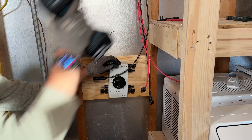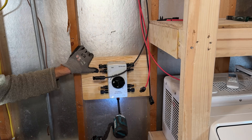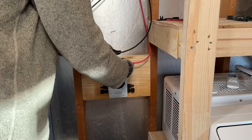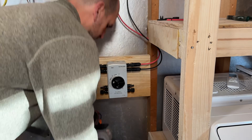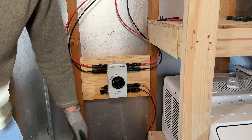The DC isolator is very easy. I have those two sets of MC4 cables coming down with two mounting screws, and then I have my DC isolator mounted. I connect up inputs one and two, and then take conversion cables - MC4 to XT60i - for the EcoFlow Delta Pros, going into outputs one and output two.